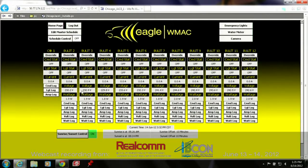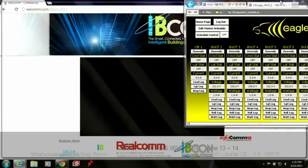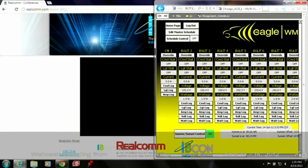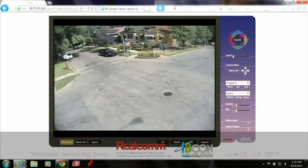If you notice the bottom line here, you can see voltage changing. We're monitoring a 240-volt circuit. Right now, because this system is set for a sunrise/sunset schedule, the lights are scheduled to be off — of course, it's daytime. And if you see the light status here, this status is not just the command status. It's true status based off of amperage or current being read from the system. So if that light was on, it would say it was on — not just because it's programmed, but because it would actually feel the current. That's correct.